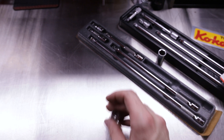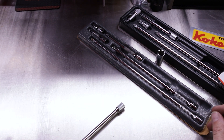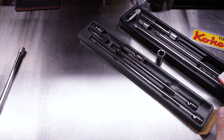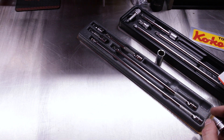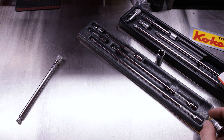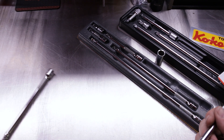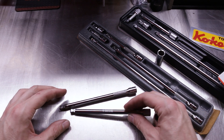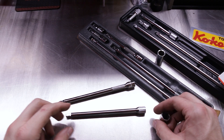If it wasn't for the lip on the stainless top, it would have gone off the edge of the toolbox. Now with the Koken — same size — the knurling and the flat spots create friction and bring the extension to a stop, knocking the inertia out of it so it won't keep rolling off whatever surface you're working on. With the Snap-on, once it starts rolling it's going to keep rolling until something stops it. Huge advantage to the Koken.